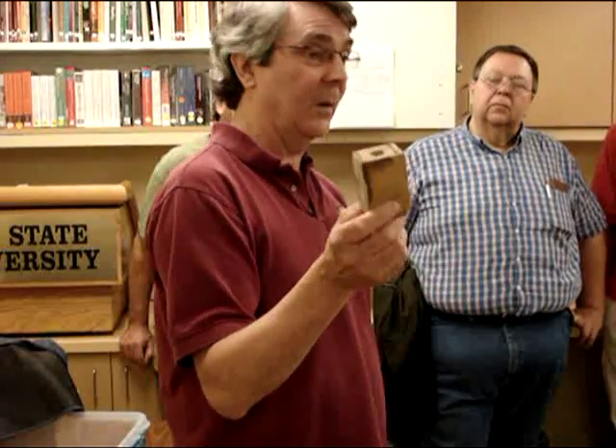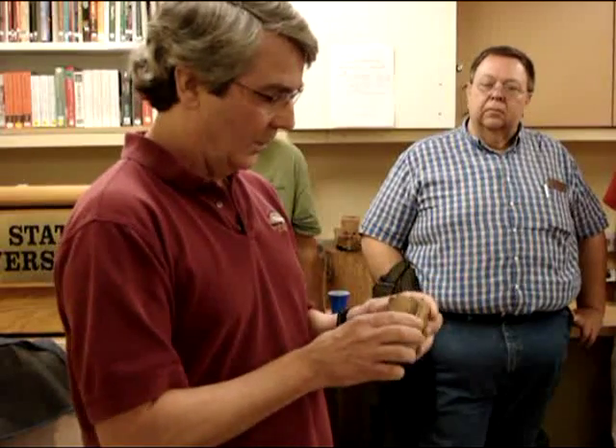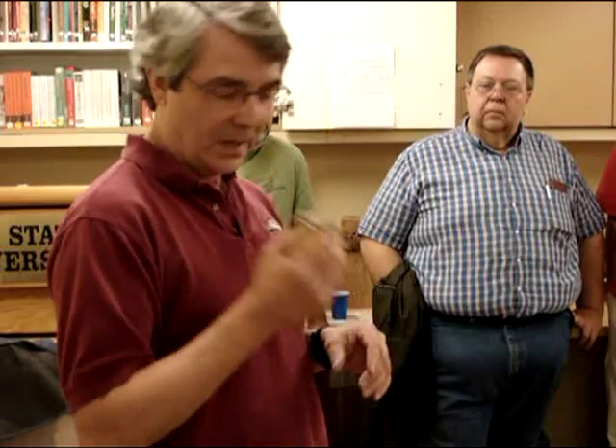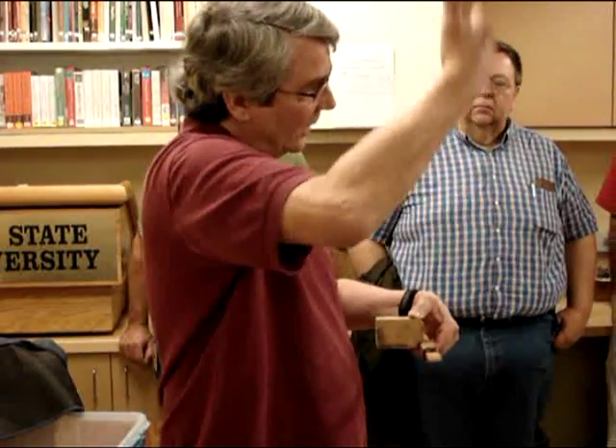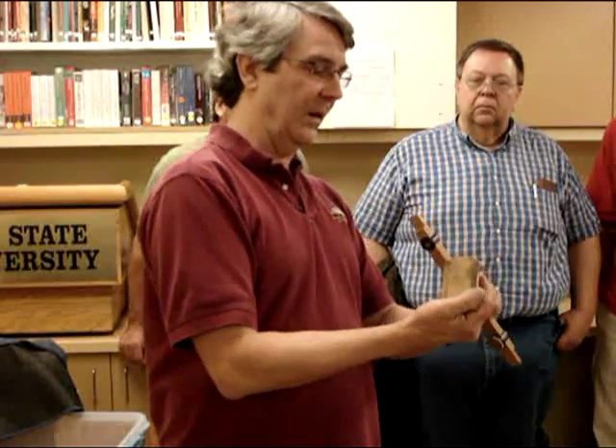This is a jig I made when I first got my Wolverine — it's an inch-and-three-quarter hole. I decided a long time ago I don't like it for gouges because it starts going deeper and you can't see what it's doing. But when I was making tools, especially the box-cutting tool out of three-eighths square steel, I used this to hold the steel up against the belt sander so my fingers don't get burnt. For box-cutting tools you have to cut back on one side for about four inches at about five degrees so the tool doesn't grab. I also have a notch for a quarter-inch piece of steel.